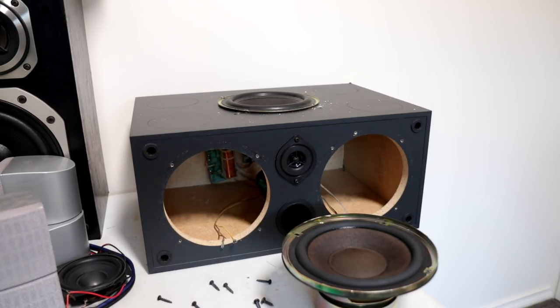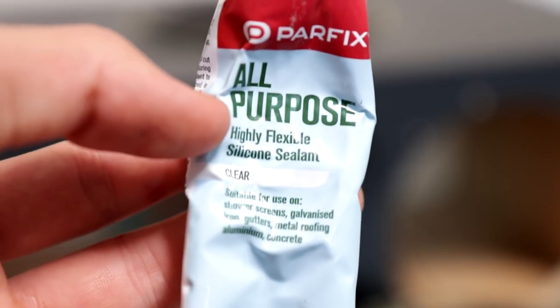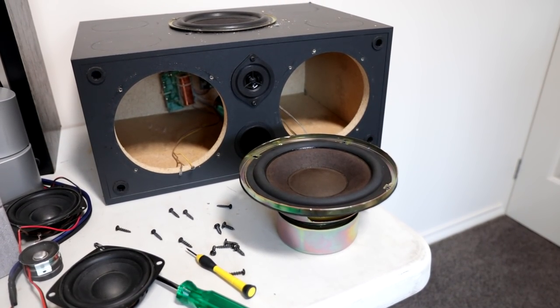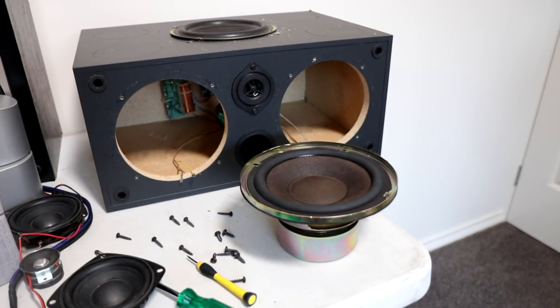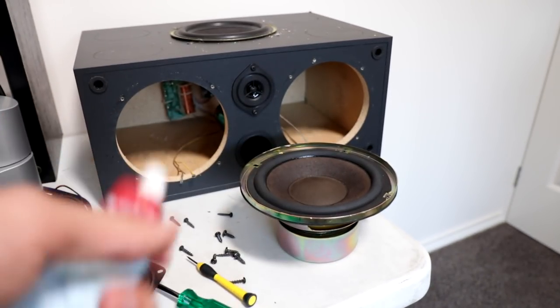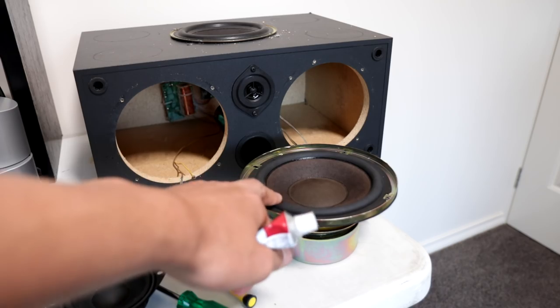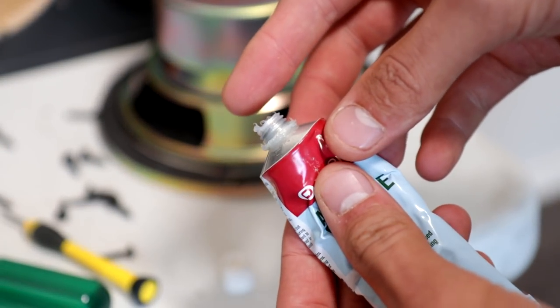Now we're going to quickly add some silicon to the back of this woofer, then go outside and cut those four holes. I'll also need to seal all of the drivers in place, because you can't have any air leaks when using passive radiators. I've got my cheap silicon sealant here — this isn't sponsored at all. The only reason I like this one is right here: highly flexible. You need it to be highly flexible, especially if you're using it on a surround because that thing is moving so much, it needs to be able to flex. I've found this stuff bonds quite well to rubber and foam surrounds. Make sure if you get a silicone sealant, it is definitely highly flexible — you can't have it be stiff, otherwise you'll probably just rip another hole. I'm just going to apply a generous amount to my finger and stick it in there — and that sounds really bad.